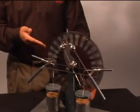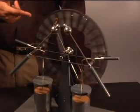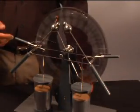As the counter-rotating discs move, the charge is distributed evenly along the metal foils on both sides of the neutralizing bars. This equalization of charge allows charges to migrate to the charge collectors by induction.